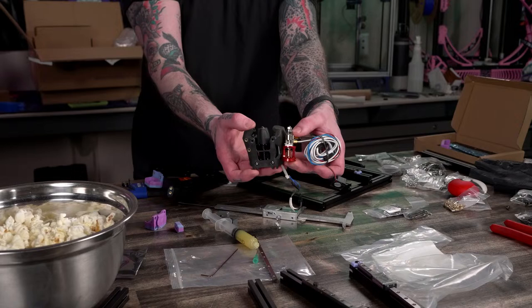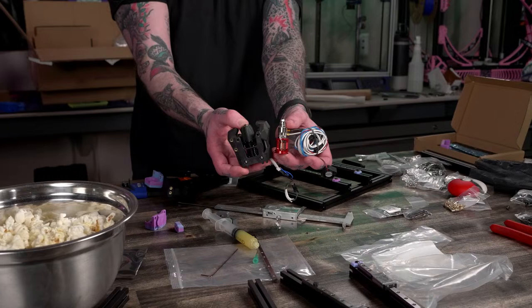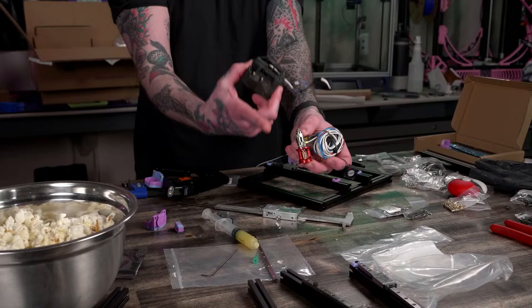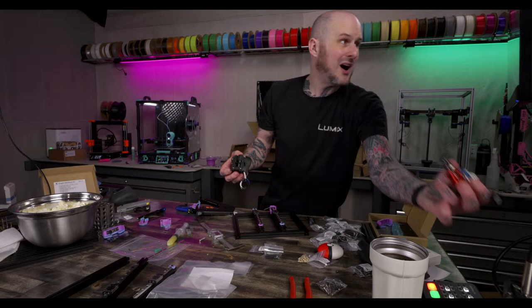So my Rapido on my 2.4, I was stuck at like 30 millimeters cubed usable flow. I maxed out at about 30 on the Rapido. With the Next G, I'm at 40. So this is a higher flowing hot end in a similar package to the original Rapido. But the square frame is over a millimeter shorter than this one.